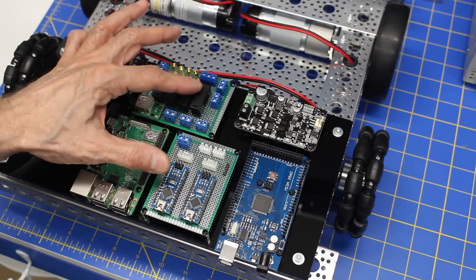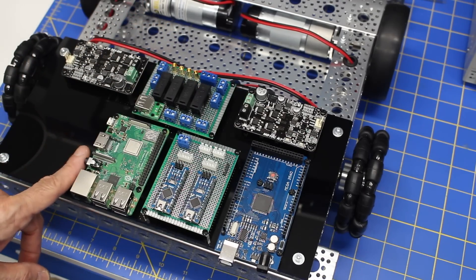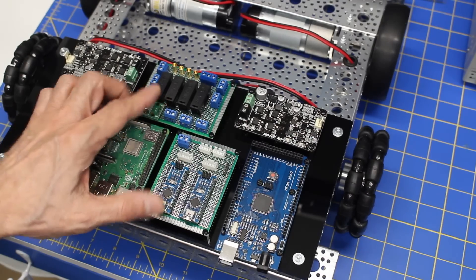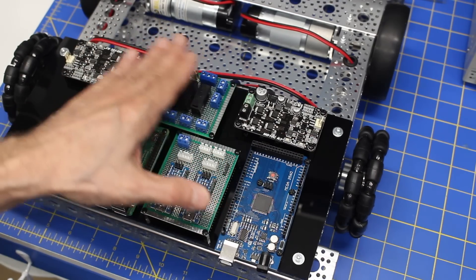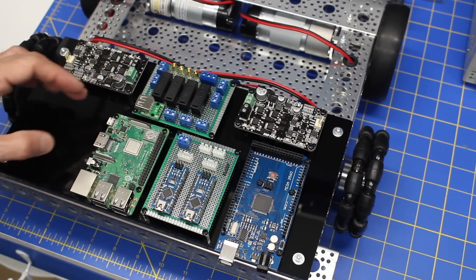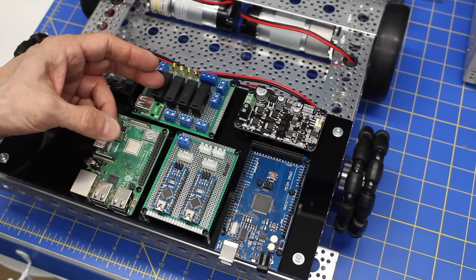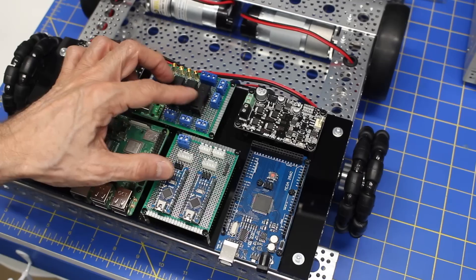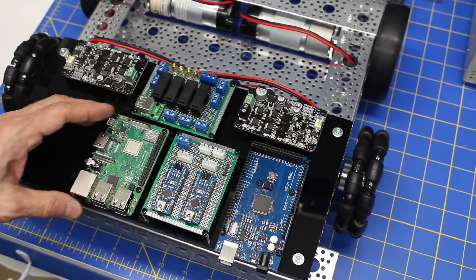I also wanted to leave some space in case the board I got was larger. Had I not done that, I might have been tempted to move the motor controller board. One design flaw I can see already is that because I've mounted my fuses here, once the tower is on, there are going to be other layers of acrylic right above it and it's going to be hard to get at the fuses. They would have been easier to access on the other side. I was aware of that, but I decided it's a design trade-off — hopefully in normal operation I would never blow the fuses.